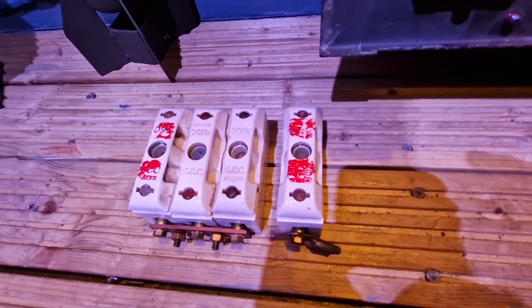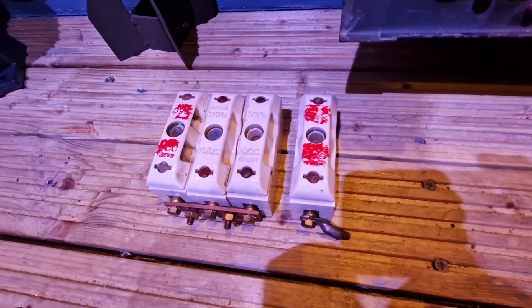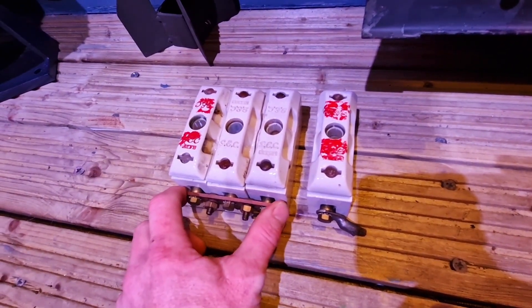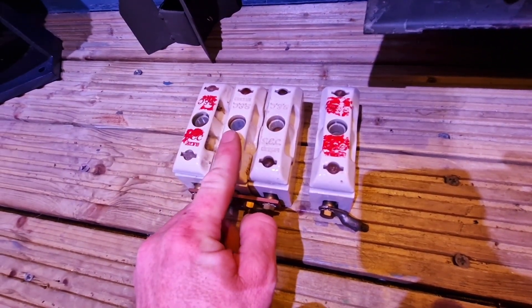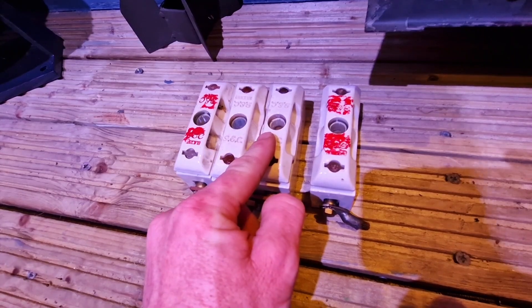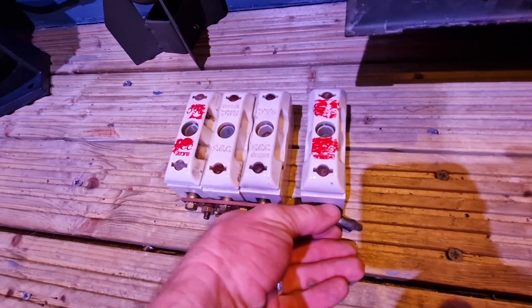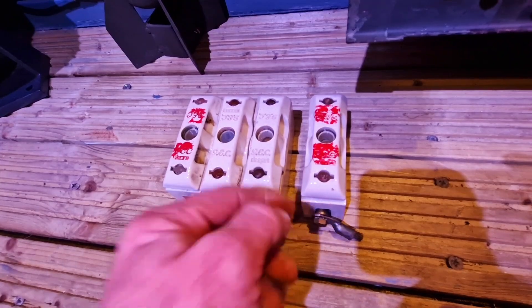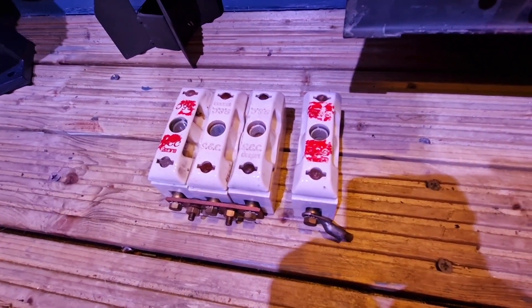The two siren motor fuses are at opposite ends of the board, and you can see the original fuses were painted red. The first 240 volt supply feeds into a busbar that's all bolted together — covering one side of the siren motor, the heater plate, and the transformer power supply. The second siren motor fuse was kept separate, coming off the different 240 volt supply at a different phase angle. They couldn't run these together because the different phase angles between them would have caused a fault condition.